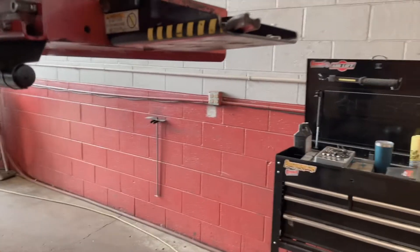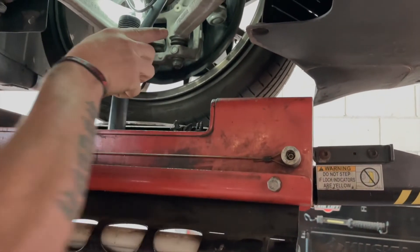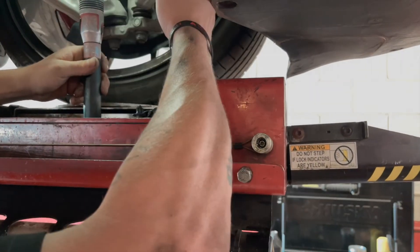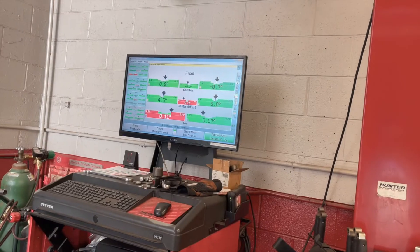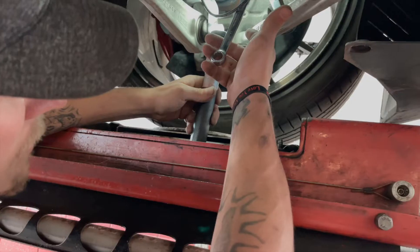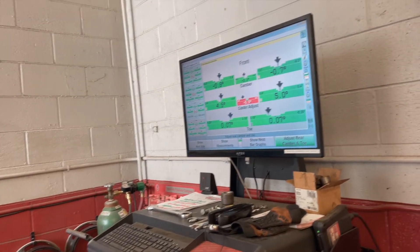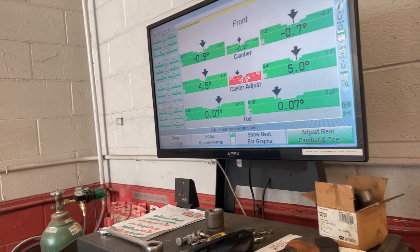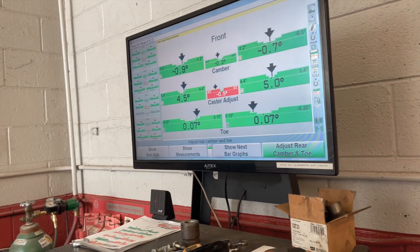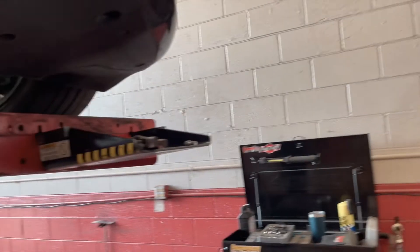That one's at 0.28. I'm wondering how much of a turn you need to change that 0.28. Let me see if I can gauge it so we can estimate what a full 360 rotation would do — go counterclockwise. So that was about a quarter turn and it went 0.05. About a half turn and it went 0.17. Roughly 60% of a turn took it from 0.32 — so about a quarter of a degree per 0.6 rotation. A whole rotation is going to be almost double that, roughly 0.4 of a degree per full rotation.